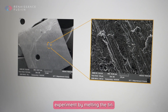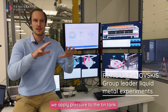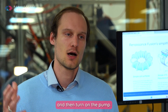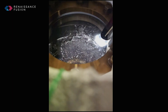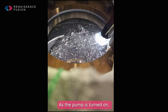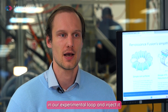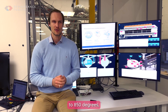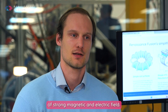We first start the experiment by melting the tin. As the tin is molten, we apply pressure to the tin tank, transfer the liquid tin to the experiment, and then turn on the pump. It starts circulating liquid metal in our experimental loop and injects it into the chamber with two high-velocity, high-flow-rate jets. They are hot in temperature — we plan to heat them up to 850 degrees — and they will be in the presence of strong magnetic and electric fields.